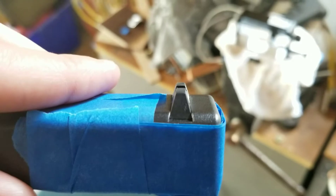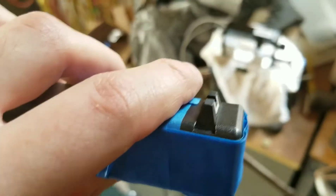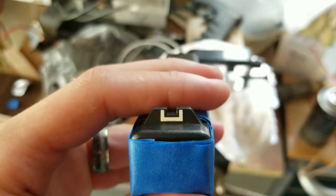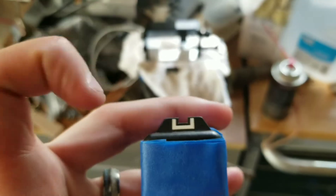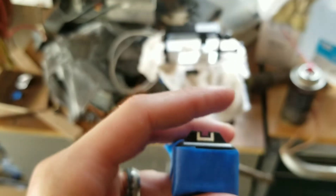It's important that you don't go past the dovetail with the tape. You want it real close to that dovetail, but not going over top — you don't want the tape jamming everything up as you try to remove the sight or install the replacement. It's best to push from left to right. Then we're going to push the new sight in from right to left.